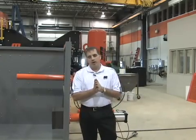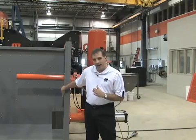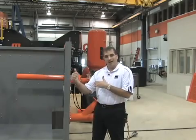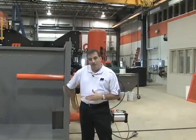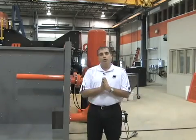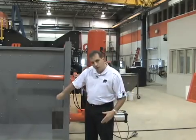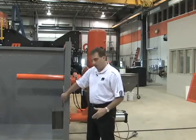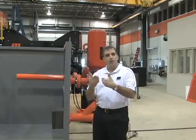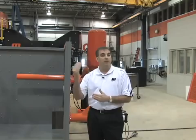Now typically in these applications you have a flat wall like I have right here, and there's nine inches — which is 228 millimeters — of refractory or concrete surface that basically protects the steel from the heat on the inside that's processing the cement. What we do is take a v-shaped fan nozzle and embed that into the refractory, and it's used to shoot perpendicular or parallel to these walls and clean off any buildup that would occur. Those nozzles are protected quite well by this refractory and they last through the campaign — a year, maybe even two years.